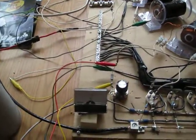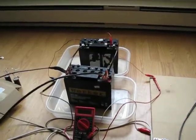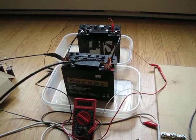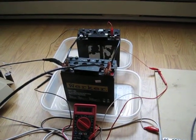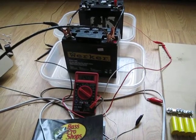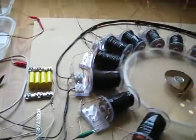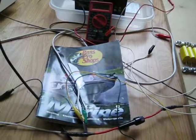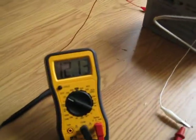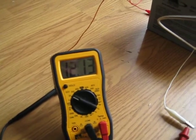Trying to keep it set at about 1.8 amps because I've got two 18Ah worker batteries over there that I put some water in. They were pretty low and they're sitting at about 14.08, coming off some of the generator coils. Got another 18Ah here, it's sitting at 12.13.